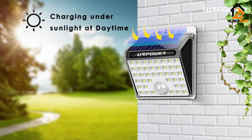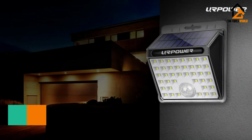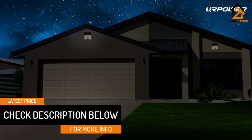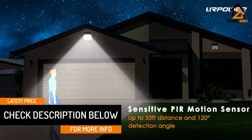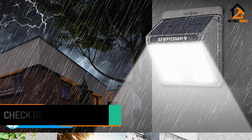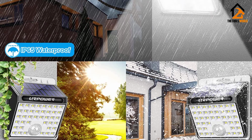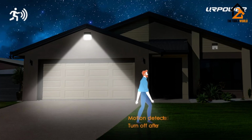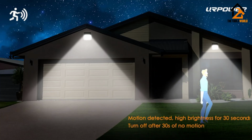After dark, we slowly approached the Urpower lights to see how close we could get before triggering them. The manufacturer lists a detection distance of 10 feet, but each one of the lights lit up when we were as far as 13 and 14 feet away. They stayed on as long as there was movement within that range, and after we walked out of range, they remained on for about 30 seconds longer.